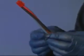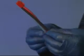Mix the compound found in the two plastic bags together until they blend into one solid colour with no streaks. Once mixed, apply to the conductors and strands within 30 minutes, as after this time the compound will begin to stiffen as the curing process begins. Spread out the cable cores to enable the compound to be packed into the crotch around the cores. Close the conductors together and bind the ends with tape. Apply compound around and in between the cable conductors extending no more than 35mm up the cable. Ensure all voids and gaps are filled.